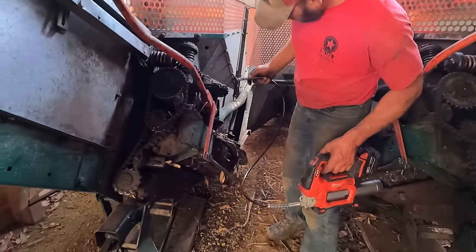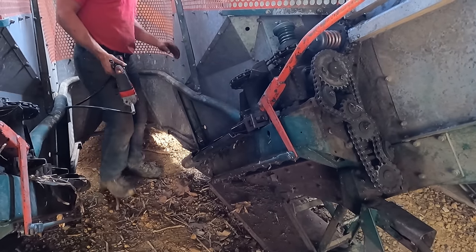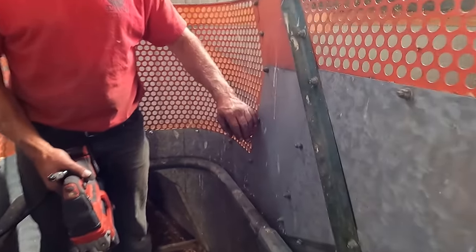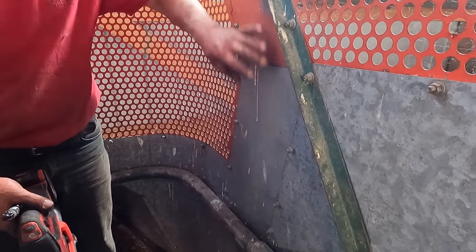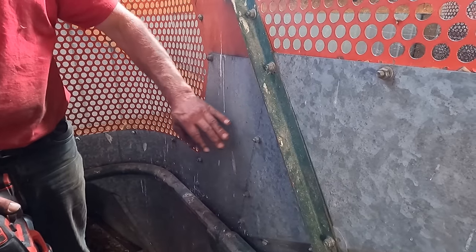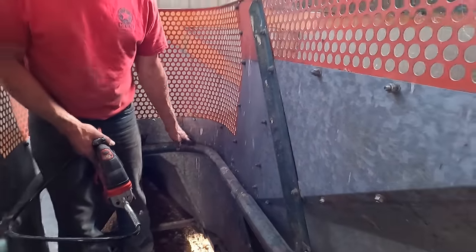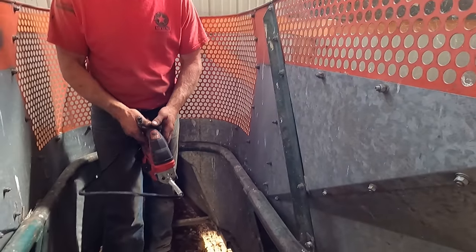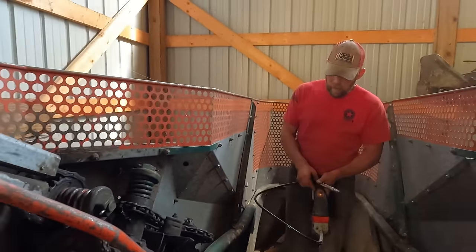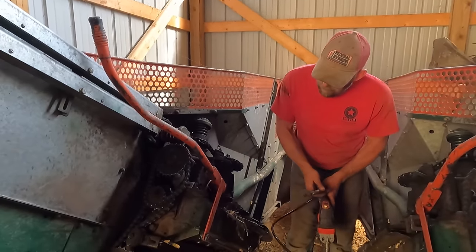We'll work on that before we put it on. And now in here, this is an extension they put on for the newer, bigger tractors that came out then. For instance, a straight M, I wouldn't need this. Maybe an MTA, I wouldn't need it neither. Because you need more room for your front wheels and things in here. So this here bar, and then this here ends up being an extra something depending on the type of tractor you have. And it's always better to have a little more room up there so you can get in there and clean out the radiator if it needs to be.